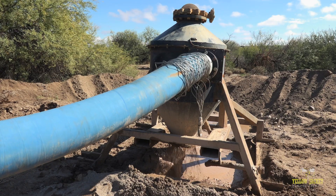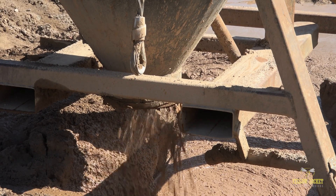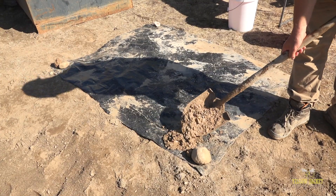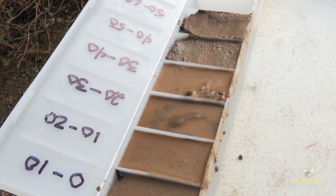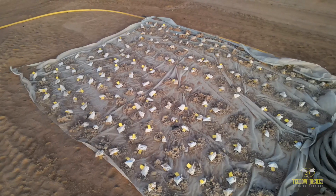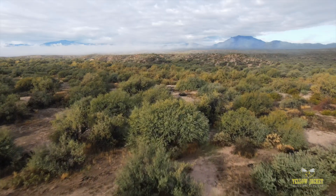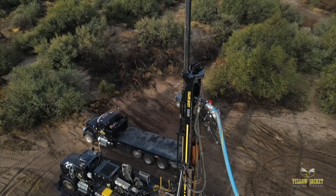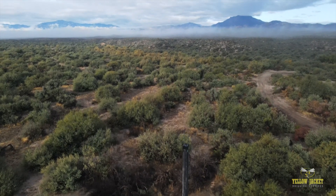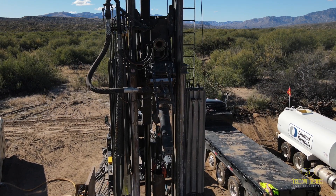Because the samples are not exposed to the borehole wall, the samples remain uncontaminated and instantly reveal the current formation being drilled. This clean sample provides easy identification and characterization of the lithology in order to locate areas for optimal zone sampling and determining well design, making this a preferred method for water wells and environmental projects when sample collection and design parameters are critical.